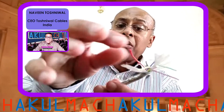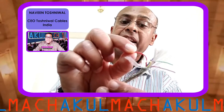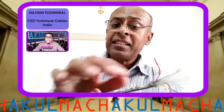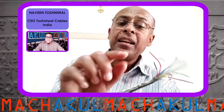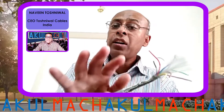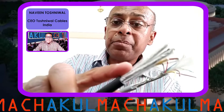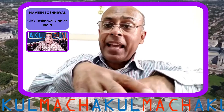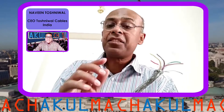Now this is a very flexible cable. Inside we have silicone rubber — you can see it is highly flexible; silicone rubber is one of the most flexible materials. Then there is a shielding of a different type. Earlier I showed a cable with a tape shield; this one has a braided shield in the form of a mesh. This has the dual purpose of providing shielding but also providing mechanical strength to the cable. However, technically speaking, braided shield has lesser shield efficiency than a tape shield, because a tape gives 100% coverage with overlap, but in a braided shield some gaps will always be there no matter how close the braiding.